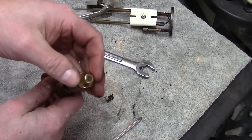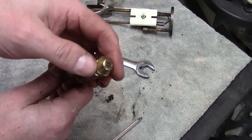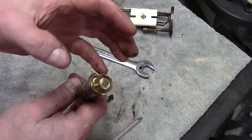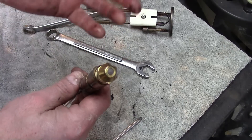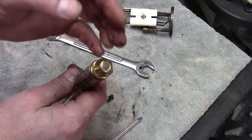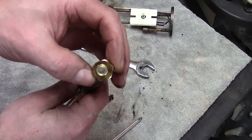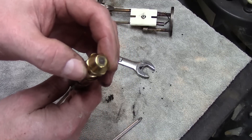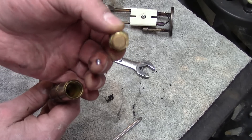These nozzles are specific to your burner, boiler, and furnace setup. They basically take the oil at high pressure and create a fine mist, which is why it's so important to have your filters and screen changed. This nozzle can become clogged as well — it's a really fine nozzle, as you can see. And they're specific, again, to the setup.